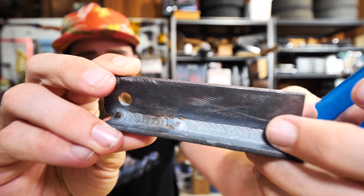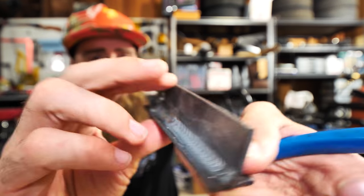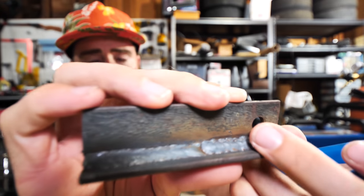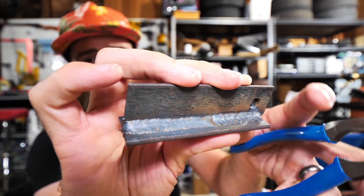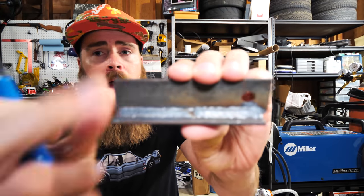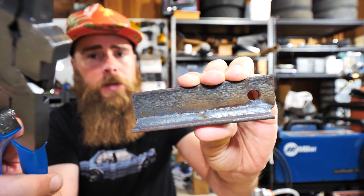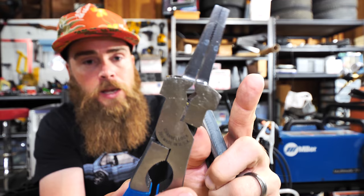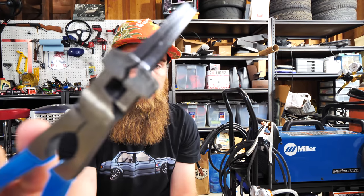The first thing — if you're doing a bit of welding, right here this is just some TIG welds. But over here we got some MIG welds going on. And when you do MIG, sometimes you'll have a little bit of splatter. Flux core, you will definitely have splatter. And arc welding, you will definitely have splatter. You can use this as a hammer to break off the excess garbage.